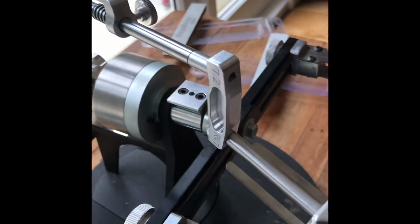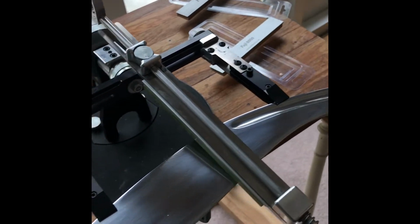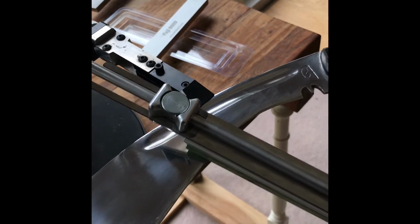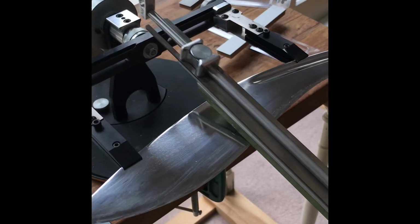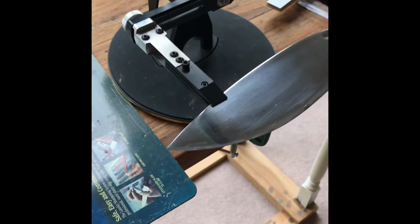Very strong, maybe not quite as sharp as a full flat grind, but hopefully the longevity from the strength will outweigh that. It's a little bit fiddly because you've got to concentrate on getting a full convex stroke onto each little portion of the blade. Still, do what you can, and it's a lot better than using a mouse pad or sandpaper on a paint stick, as other people have mentioned as an option.